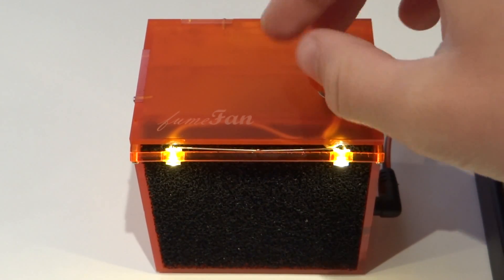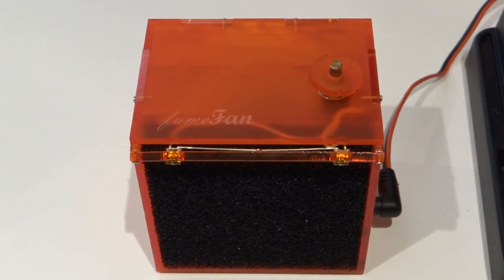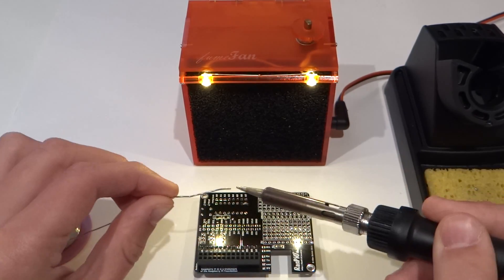So here is the Midi. It has quite a few differences from its younger brother and quite a few similarities with its older brethren, which we'll see in a second. It requires 12 volts, which means the Midi is a fair bit bigger than the Light, with a greater max airflow of close to 1.32 metres cubed a minute. Not only that, but the airflow control is completely variable and these two LEDs light up your work very well. As you can see, it draws in every fume perfectly.